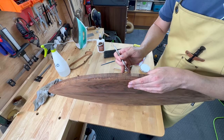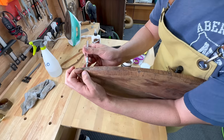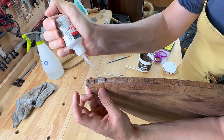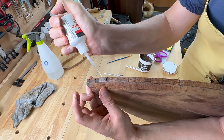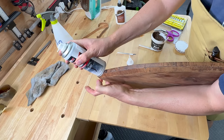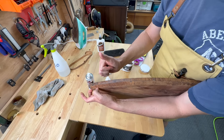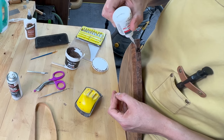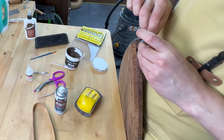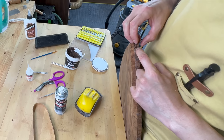There were lots of very small imperfections in the veneer and I didn't want to replace them with veneer pieces because I don't think that would have looked better, so I just used some wood filler. For the pieces that were loose I used CA glue and activator to attach them. I'm not going to show you all the repairs because there were just too many of them, but basically: if there was a gap like this one I used a piece of veneer, and if it was something very tiny I just used wood filler.